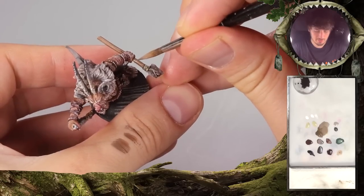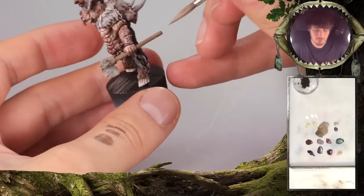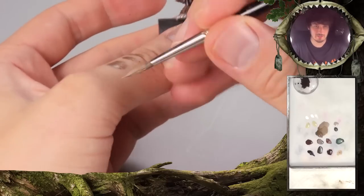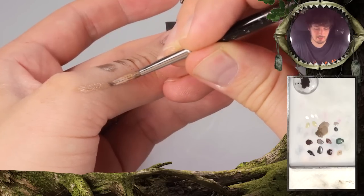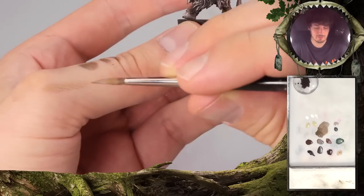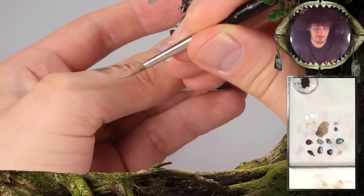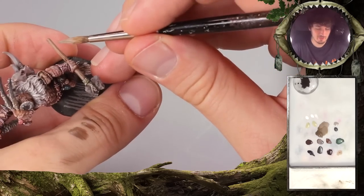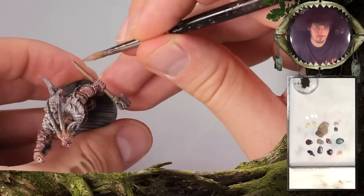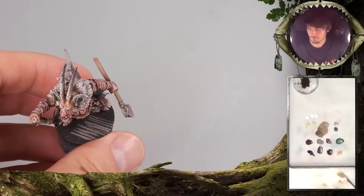The way you hold it and the way you draw these grain lines is very important for the look. The starting point will be thick, and then it will run out into a fine line at the end — even a spike running out. So if you want the highlights to be at the top, you start from the other side, so you have more of the lighter color applied at the end where you want more light.